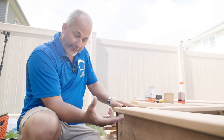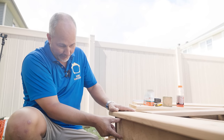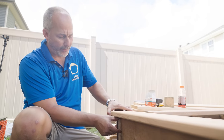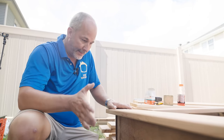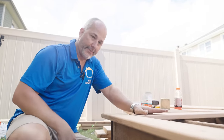And then the best way to finish it is to take some cedar, whether it's the same kind of board or like a 1x3, and put it across the face for this to sit on, all right? So then you know what that depth is. You add the 3/4 plus the 3/4, go 1.5. You can finish with that and then put lattice to the bottom. That works great. So you don't exactly know where the end is. So when we're putting on our boards, we're guesstimating here, right?